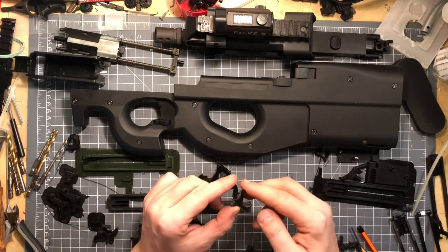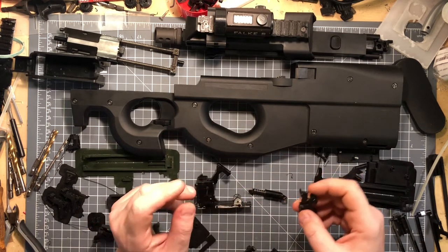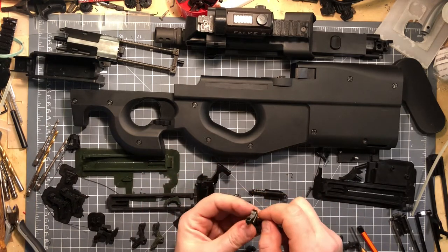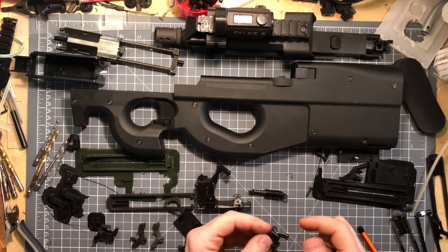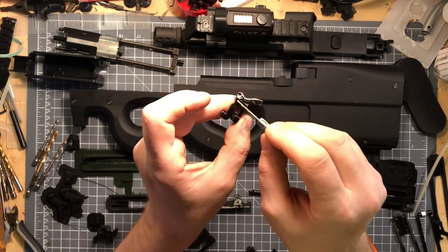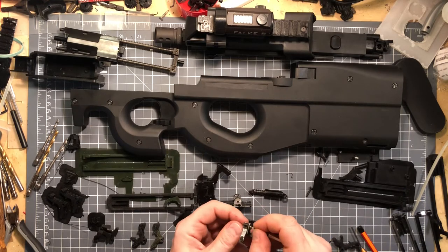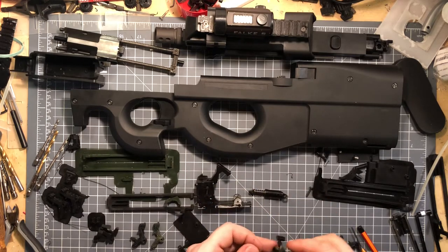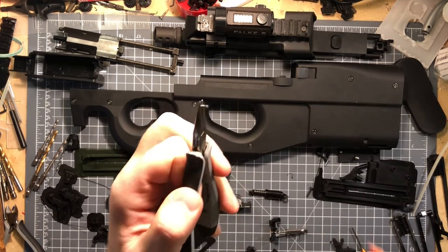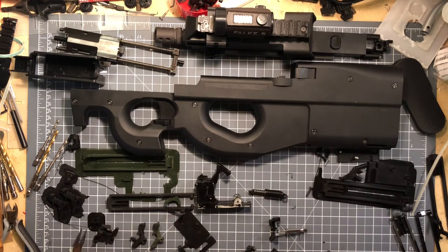You've just got a small pin in here — 1.5 millimeters. It's the only one I've got, I don't have any others. So I just usually push this out and use a 1.5 millimeter drill and it usually works. There's a bigger side — you can see one side is bigger and one is smaller — and which way you put it in is important because it puts the tension on there. Keep that in mind, it's very important you don't lose it.